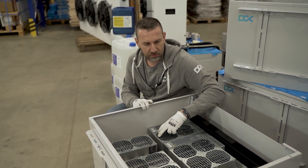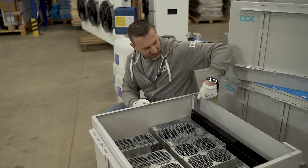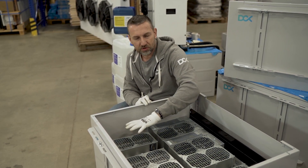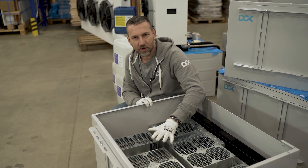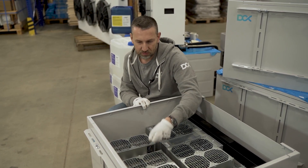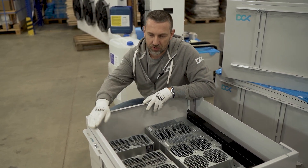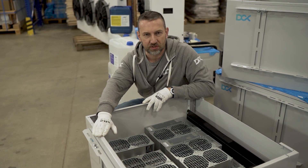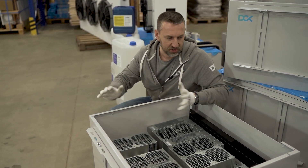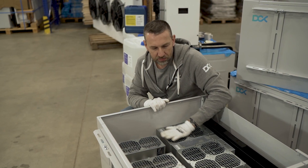Please remember when configuring your systems - there are small hooks here along the sides. We put them here to make sure you can route all the power cabling on the sides of the enclosure. Please don't let power cables or ethernet cables lie on top of the miners where the heated fluid is. Route them along the sides and evacuate to the back of the enclosure, or route them to the front - that front element is removable so you can wiggle it out and route all cabling to the front if you like.